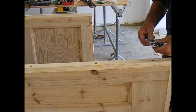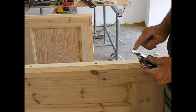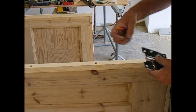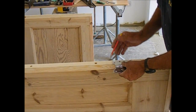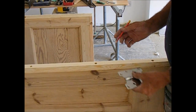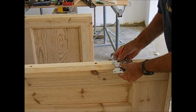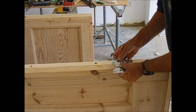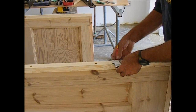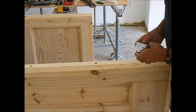When using standoffs, you know the size of your architrave. The standoff, if you was to put this part of the hinge to the door, the standoff will be the total of that. Well, you don't need all of that. So it's wise, I think, to put it slightly more into the door, and then in the frame you match it. So wherever this comes on the door, you make the same on the frame.